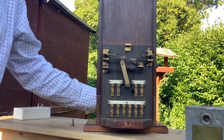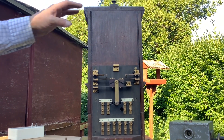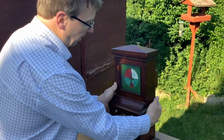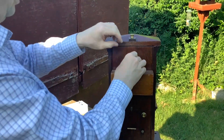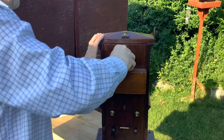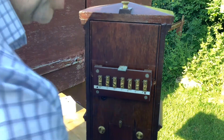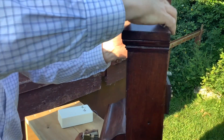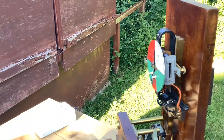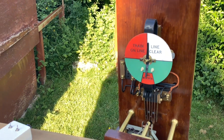I've seen another one like that which was off the London Midland Region. Here's another instrument — nice, smart, good condition. Look on the back — a small box with four-five-six-seven-eight-nine terminals. If you look on the inside you'll see how it does it: there are vertical spring contacts, a bit like the early ones, so you move the commutator from side to side and open and close the contacts. That's another way of obtaining the same circuit.